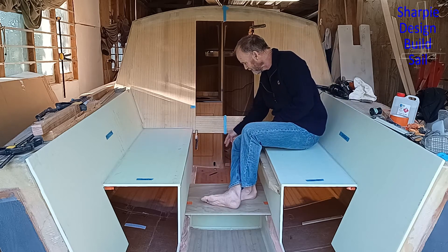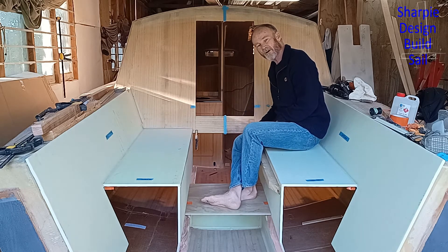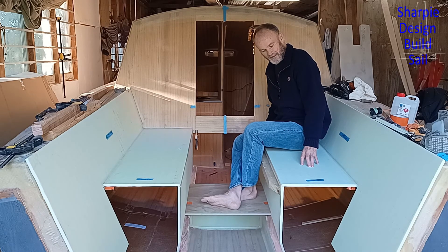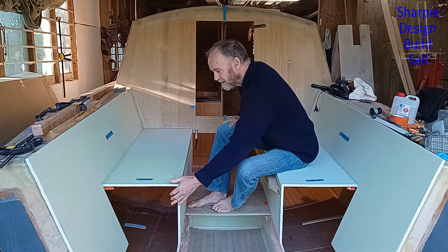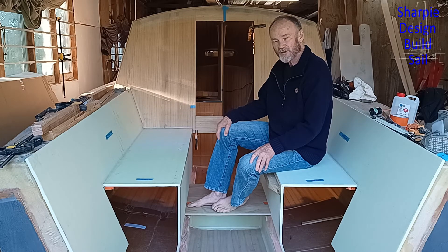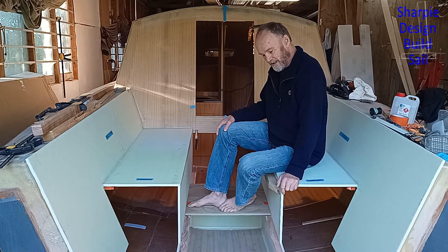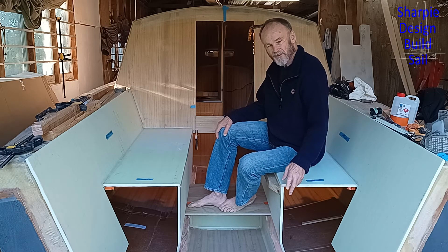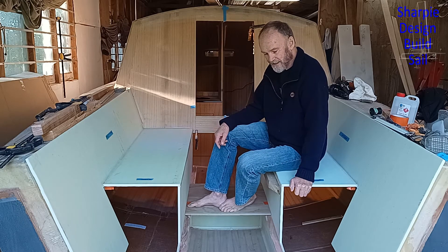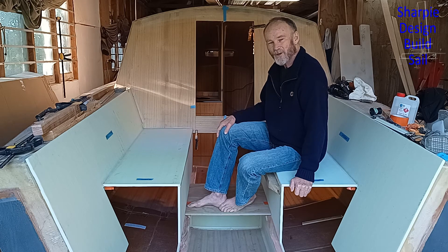I've got this bulkhead to go in here, and that'll be in Paulownia once again — one of the few remaining Paulownia jobs — because visually from the inside I want to see the grain and not this foam panel. I've got a few missions in town to do today, but hopefully I'll get to glue the ends on the cockpit seats and get at least two layers of glass on the cockpit sole on one side. There's very little left to do inside here, but I'll probably give it a couple of layers of small pieces of cloth where those bolts go through the transom, and then sand it out and put a coat of resin in there before I put the cockpit sole in. Very happy. Thanks for watching and I'll see you next time.